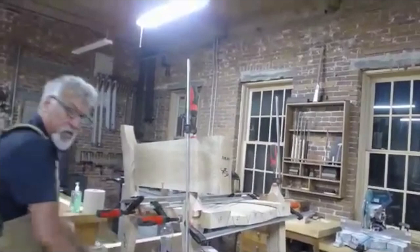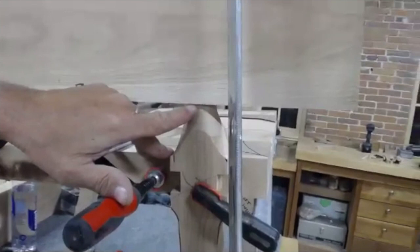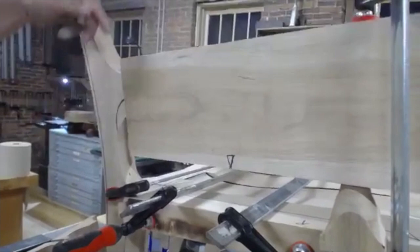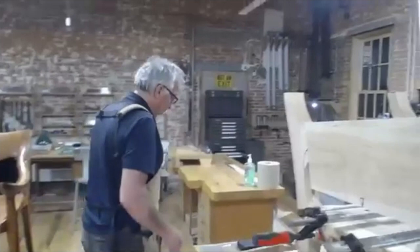Okay, you bring your camera over on this side and look at this, just this vertical part right here. So we're flush on the front leg. We want flush. We're flush on the back joint. But if you look, because that's a compound angle, we've got a big gap on the inside. So we have to compensate for that, right? So the way I do that is,